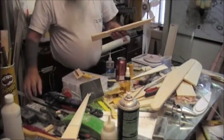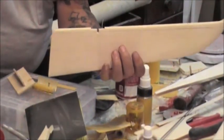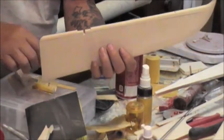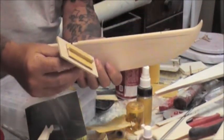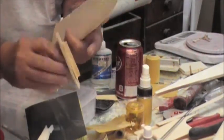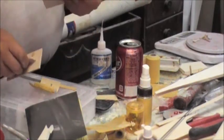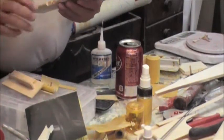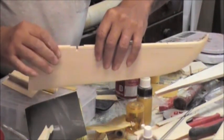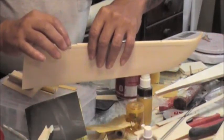First off, let me give you a close-up view of the notch that I sand into that right here. And I've made a tool. It looks normally like a regular hinge slotting tool, except there's a center in there. And what you need to do is sand into this leading edge of this piece right here half the thickness. So if this is 3/8, this notch is 3/16 deep.